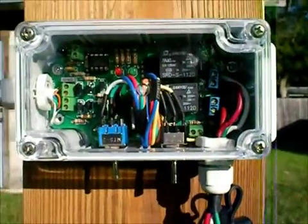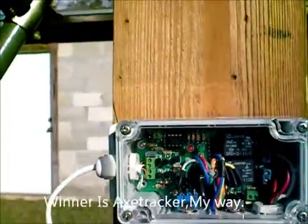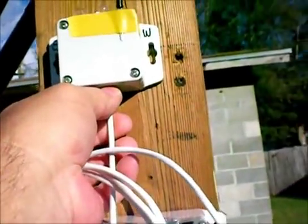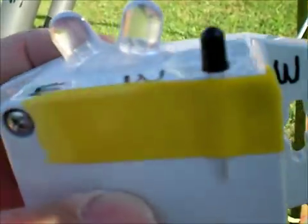As promised, here's the solar tracker controller I'll be using in my kits. I finally got the proper boxes, including the one for the LEDs. This back piece goes on the top of the solar panel — east on one side, west on the other. That little black piece is the photodiode. I put mine inside the box, which eliminates false signals I was getting from street lights — that's why it wasn't parking.